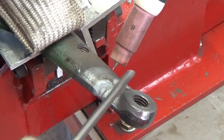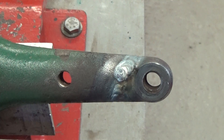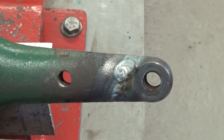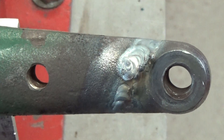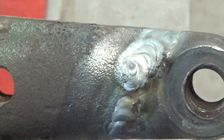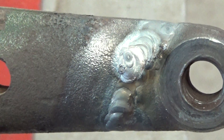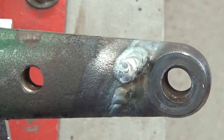Gravity's pulled this through the back a little bit, so I'll run another light pass at the top only so that when I sand the back it's all flush — I'll do that off camera. Like I said earlier, this wasn't supposed to be pretty, it was supposed to be effective. I knew I was going to be able to sand it back to the profile of the original surface anyway, so I'm not worried it's a little proud.